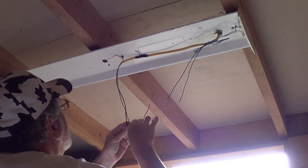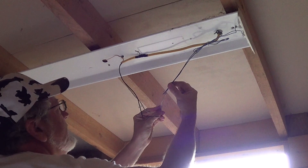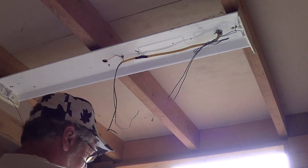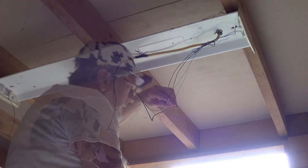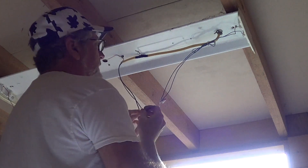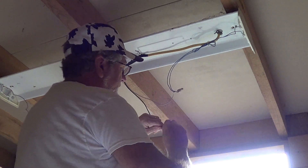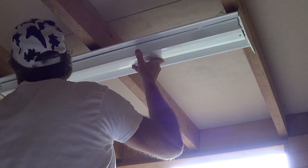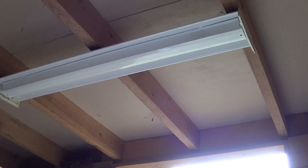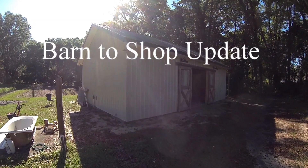Here's our power in — the ground is already hooked up. We're going to connect this side to neutral and this side to hot, that's all you've got to do. Pretty easy. Put the wire nut back on — that's the neutral side. Put the bulbs in and see if it works — BAM, nice!